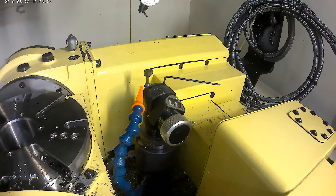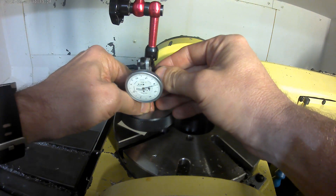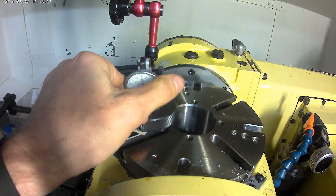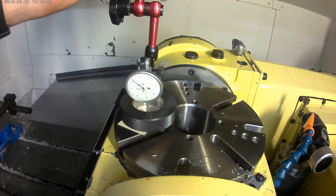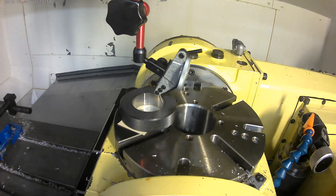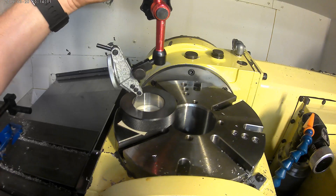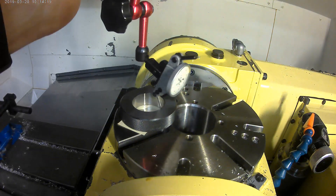Now that my equipment is indicated, it's time to put a ring gauge inside the machine. I use a 40 millimeter, but any size you have is going to be great. The Renishaw software does not require you to find the exact center of this ring, but I still want to do it manually so that I will have a reference datum once I've calibrated the spindle probe — to know exactly how far off my calibration is. I'm just going to use a standard indicator and sweep the center, and once I have that exactly where I want it I'm going to set that to a work offset, just as if it was a piece of scratch paper. I want to be able to, after doing this calibration, probe the same ring and find the result from Renishaw and see if it differs at all from the origin that I pick up manually. So I'm going to get this just right on the button.